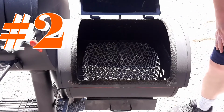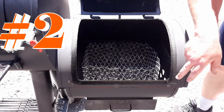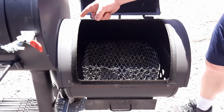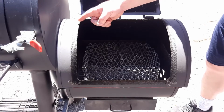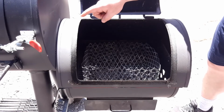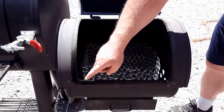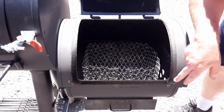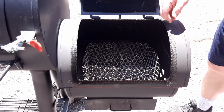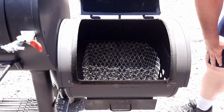The next modification I made was to install this gasket around the firebox. Basically, I used this, I guess it's a high temp gasket material that you can find online, and I'll put a link to where you can buy this in the description also. And it's just attached with the sealant. I just used a bead of the sealant to attach it to the firebox.